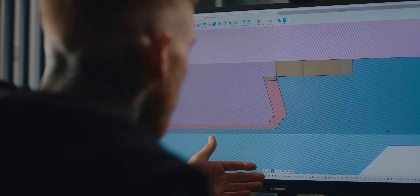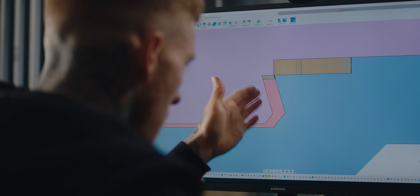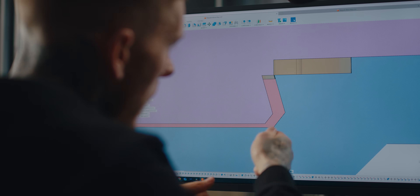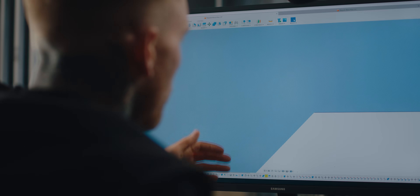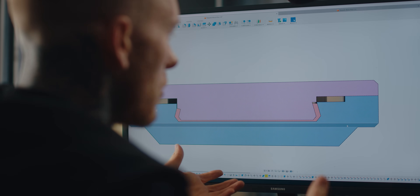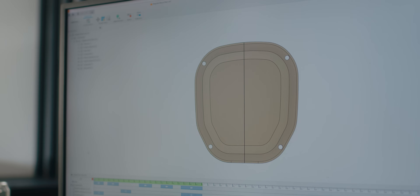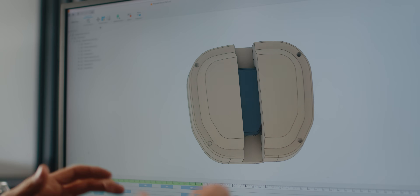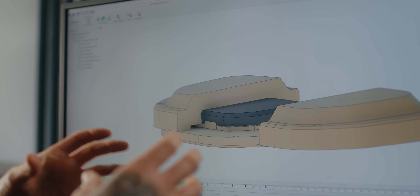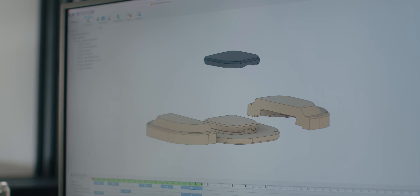The way to overcome this would be to eliminate at least one of the draft angles. Because the part's flexible, if we can just get one side off, then we can peel the pad off the other side. Obviously, I can't make those changes to the pad itself because I can't change that geometry, so we're going to have to make those changes to the mould side. One route I could take is to have one of the sides split perpendicular to the main split line — this way I can slide the two halves apart, avoiding that undercut issue, and then peel the pad off the other side.